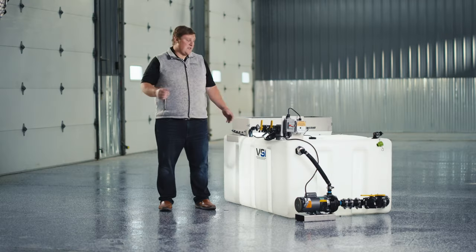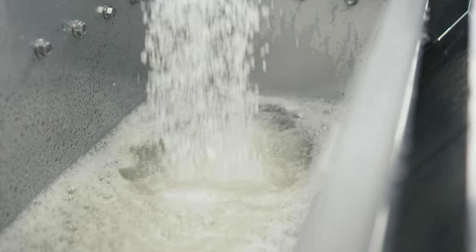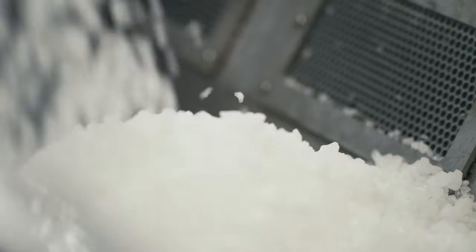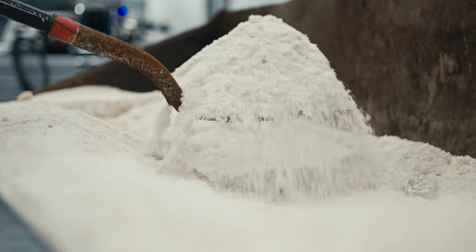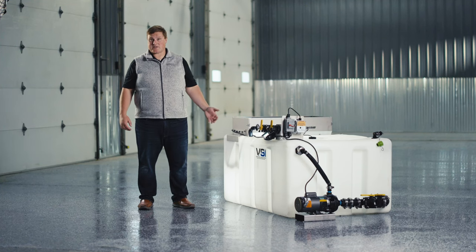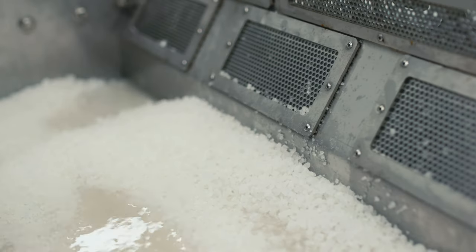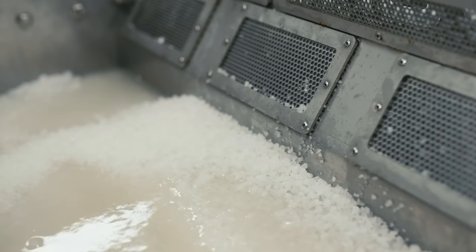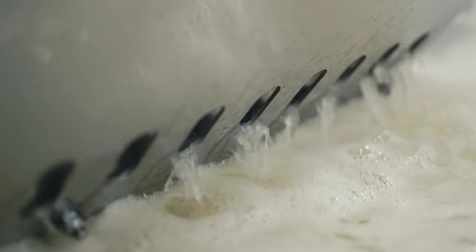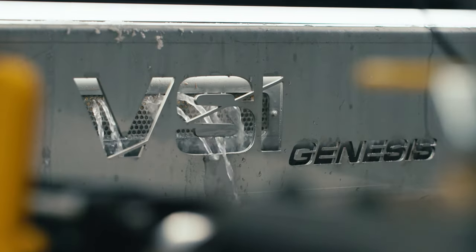This system has a 300-pound manual load stainless steel hopper. Contractors using this system are typically either using bagged salt to load the hopper or shoveling bulk salt in out of a skid steer bucket. The hopper holds around 300 pounds, though it takes closer to 650 pounds of salt to actually make a batch of brine in the 300-gallon batch tank. The system makes around 900 to 1,000 gallons per hour — around three or a little over three full batches per hour.